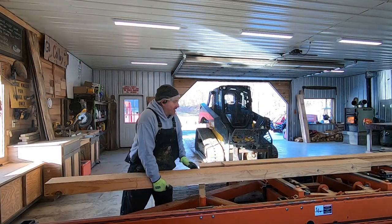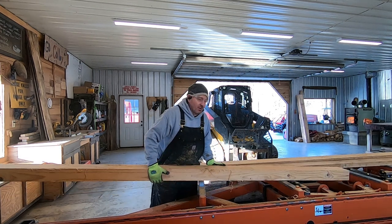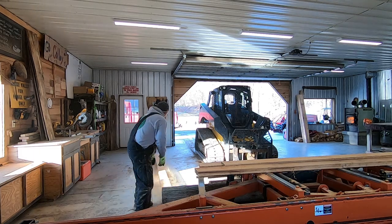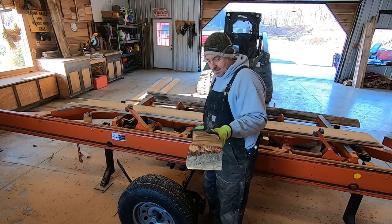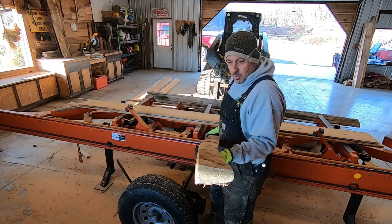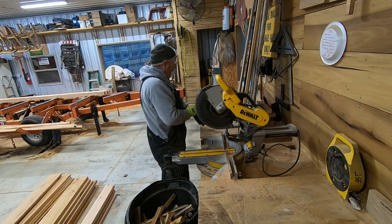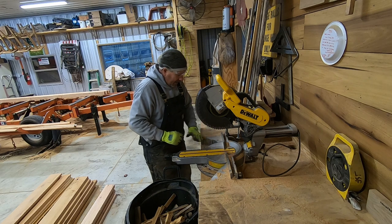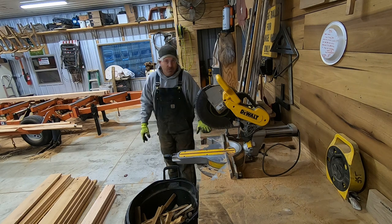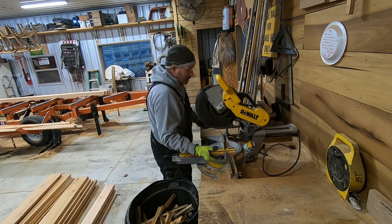Now we've got a true four-by-six — that's something else with this cedar. Earlier I showed fresh white oak: I couldn't lift it, this thing was so straight. But as it dried sitting in the shop, look how it turned out — beautiful white oak moves so much. Anyway, it took about an hour and a half to cut all three of those poles up. I've got all the lumber I need, so I'm going to do my cut list. First item: balusters — cutting 36-inch balusters. I've got a jig set up, so I square one end, slide down to my stop, cut the other end, and cut all 56.